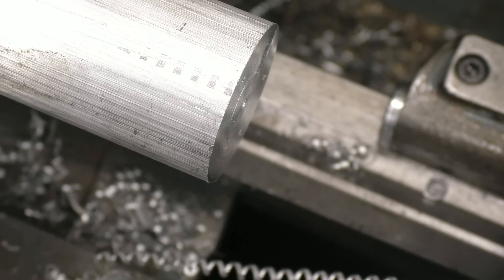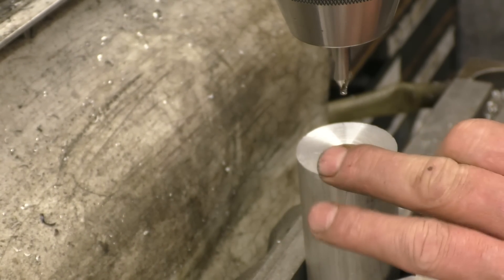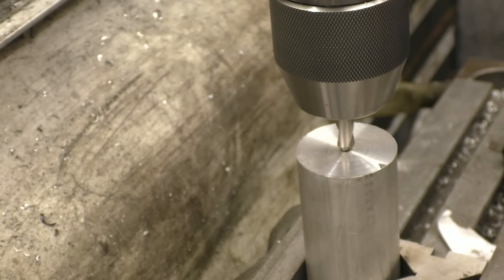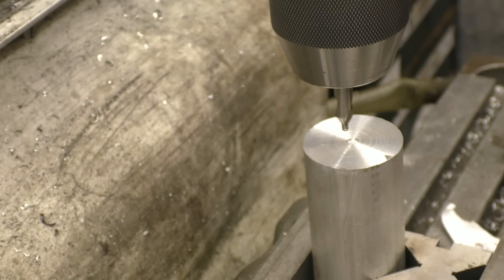Right, that's the first blank done — I need two like that. I've put it on the milling machine just so I can accurately mark the 7mm offset. There's nothing to really stop us drilling it on here because I've got plenty of material, so I don't need to go all the way through to the bottom. So the first thing I do is wind in the 7mm offset — that's it there — and I can tighten up both axes on the machine and then in with the hole.